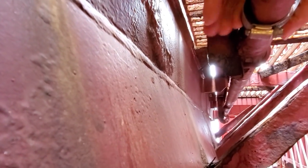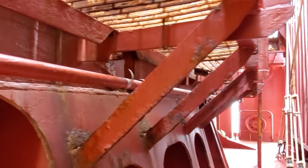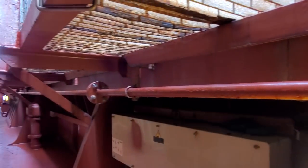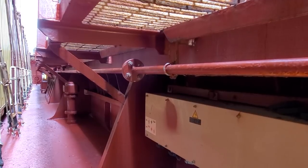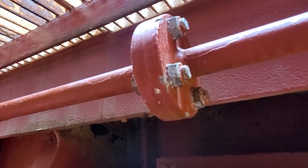Here's the leak right here. There's a soft patch on it but it's leaking underneath that. On both sides there are valves where they can hook up to do work on deck with air. I'm going to start removing these flanges so we can remove this pipe. I've already isolated the air so it should stop in just a minute.